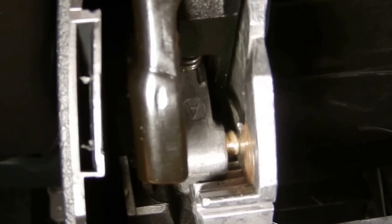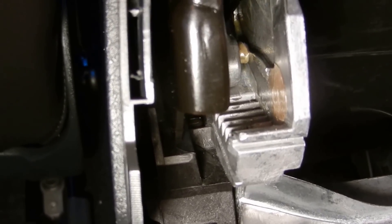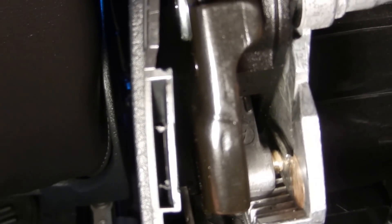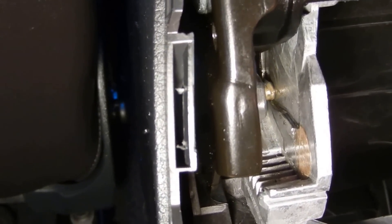So it goes up three spots, and then when it goes all the way up — or further up — it clicks and allows the pin to click into that trough right there, so you can lower it. The ratchet lever arm bypasses the ratchets and it goes and clicks back down. You slowly click click click, then up, and the pin drops into that trough right there. And back it goes.